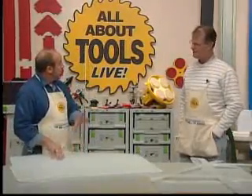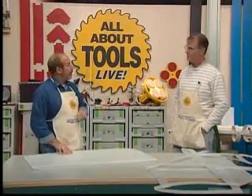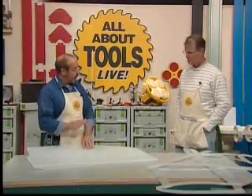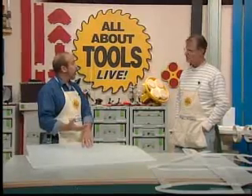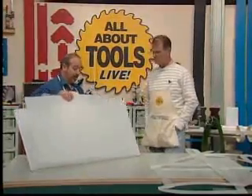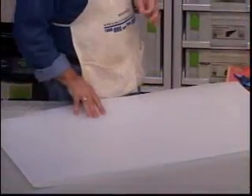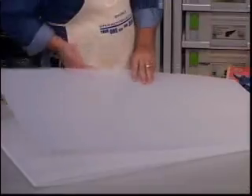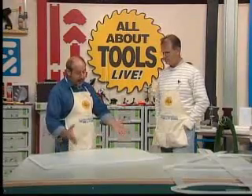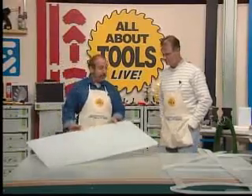It's waterproof — when we left to do the field measure it started raining and we had the templates in the back of the truck. Had that been cardboard it would have been a problem, but with this it makes no difference at all. So if you're working with stone or anything that requires water, this is a great product. It's relatively inexpensive and it's reusable. It's very similar to Coroplast, and I believe Coroplast is a little bit less expensive, but the ability to see through it is kind of nice — you can see dividers, a trouble spot, or whatever without having to get underneath the counter. A lot of times you'll just notice things like, 'Oh, I've got to mark that divider because my sink's going to overhang.' Great material.